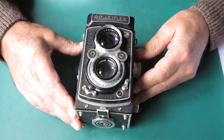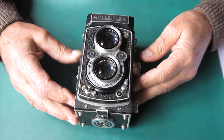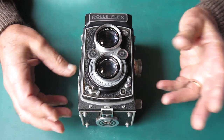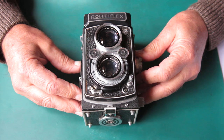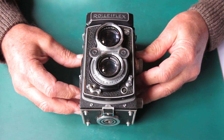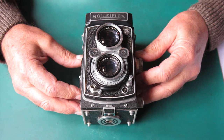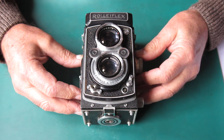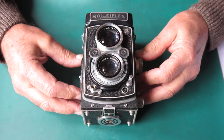So what are its problems? Well, the shutter — the shutter is probably the most obvious problem. The most obvious issue with the shutter is that the slow speeds are all the same, which tells me that the arm on the retard gear train is probably just stuck in, so it doesn't swing out to its normal start position and therefore it is not running down. It's already run down, so all the speeds are quick.